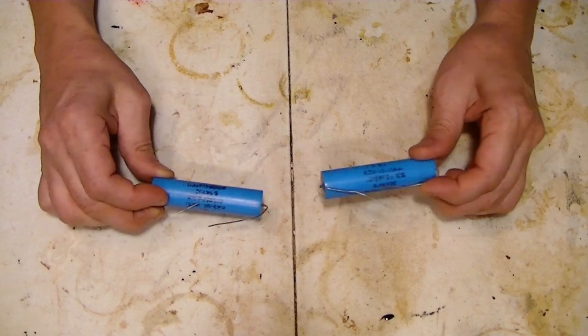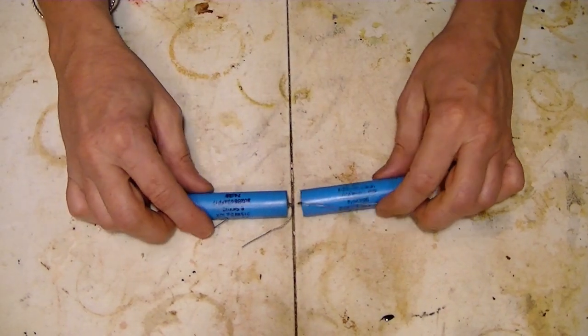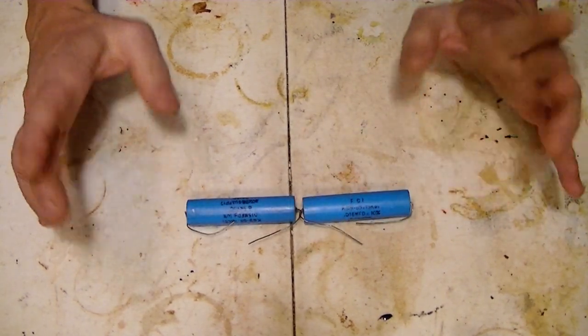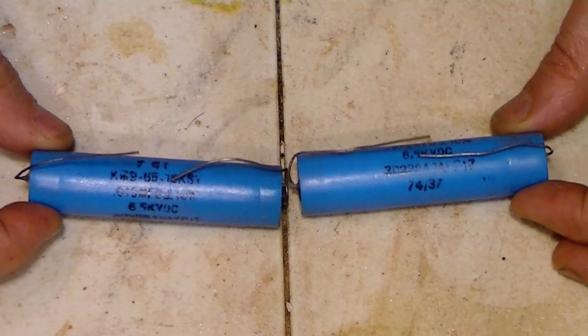But that's okay, because I learned that two of these blue ones has the proper farad value for my Tesla coil. I know if you put one in there, it doesn't work and blows out immediately. If you put two of these in series, it works great, and it allows it to work for a while before it blows out the capacitors. So let's have a look at these